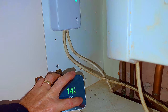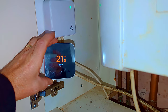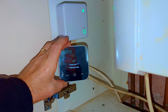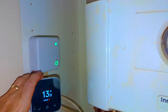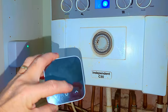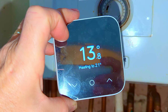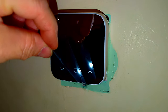Briefly back to the working thermostat — all I need to do to operate it is press the up arrow; you can see the temperature rising, and then any second the green light is going to come on and turn the boiler on. There's the green light and now the boiler is on. The thermostat will go back to showing the actual temperature of the room — the house here is only 13°C because the heating hasn't been working. Now we'll see the blue light come on the boiler indicating the burner is lit. If I touch the middle button it lights the display up showing the actual room temperature, then the temperature the heating is set to — which is 21°C — and then the screen goes out.